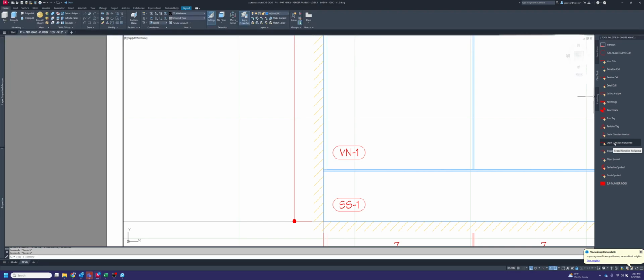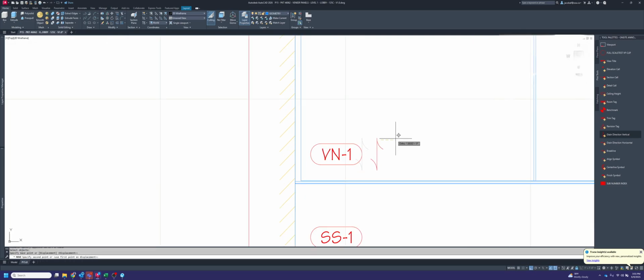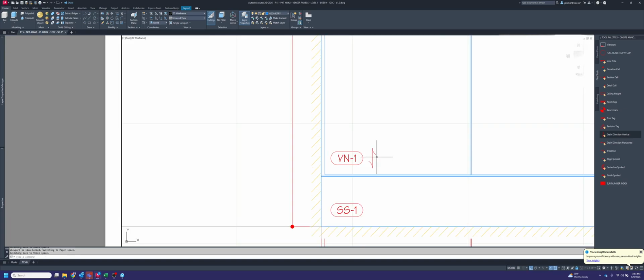Whether it's cabinets or panels or wherever it's being used, you want to verify that it doesn't have any grain to it. If it does have grain to it, then you do need to add a grain direction call to the print. And those are really easy to add. You just click and drag right from your tool palette into your print. And usually what I'll do, again, is stack it on the side of my view call, and then I'll move it over 2 inches to the right or so.